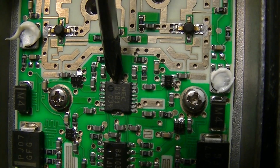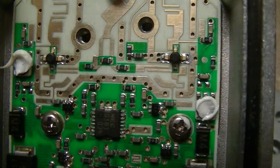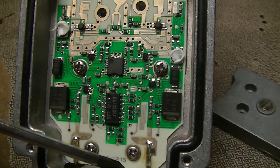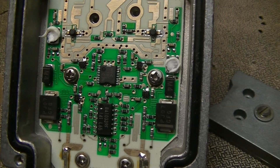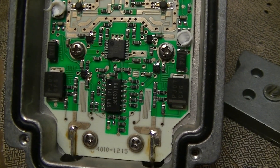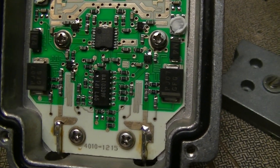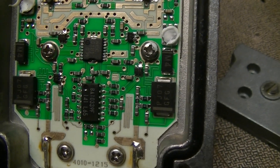It's an NEC UPG181GR twin IF switch. So there's obviously some kind of signal sent from the cable box so that it can switch between which of those two signal polarizations. It also gives more channel capacity in one signal by having two different components that are differently polarized.